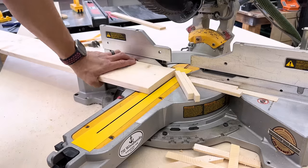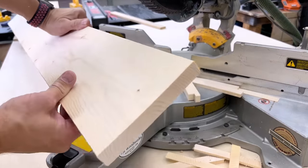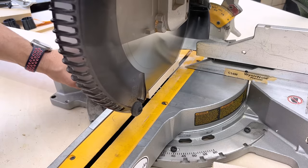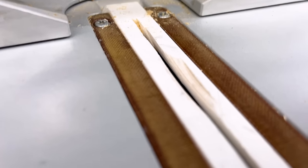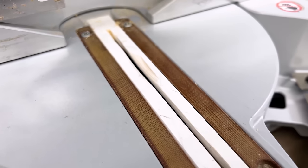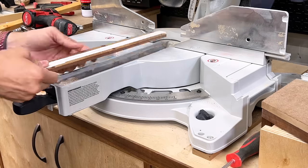This produces a much cleaner cut on the bottom side than if you're using the standard throat plate, because that throat plate has a very wide opening that leaves room for little bits and pieces to fall down in there and causes a lot more tear out.